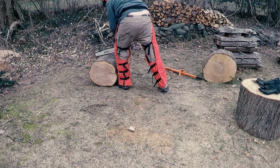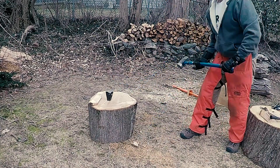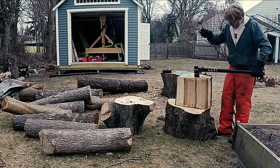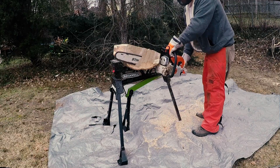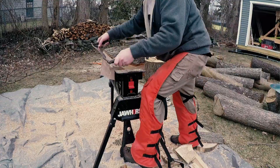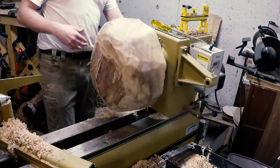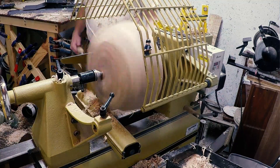To get my blank, I started with a piece of Norway maple that I salvaged from a neighbor's yard. I split it in a very inefficient fashion, then split off the pith layer. I marked off the circle, split off what I could, and finished it off with a chainsaw. I usually do this with a bandsaw, but as the blanks get bigger, this gets a little unwieldy. I then used a draw knife to clear off the bark and soften the sharp edges with a power planer.